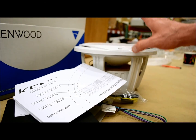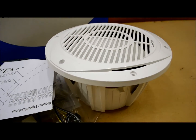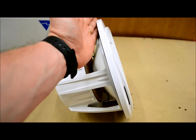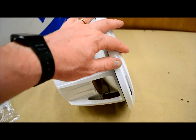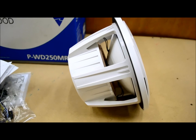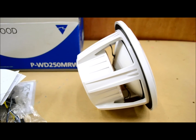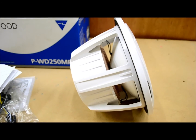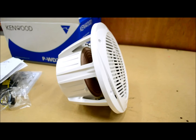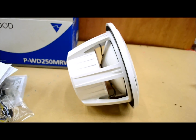When mounting these woofers, make sure they're in a free air application — that's where they perform their absolute best. Free air means open air in the front and open air in the back, with no sealed enclosure. Do not mix ported, vented, and free air woofers in the same boat because they will work against each other and it won't sound nice. You can add as many of these as you want — I've seen people put up to four in the back of their boats.